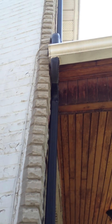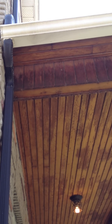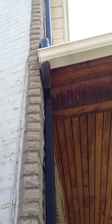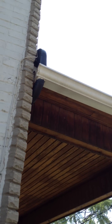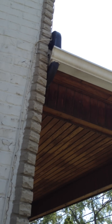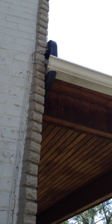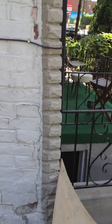I finally discovered that the eaves trough was really the main problem. There was water streaming down in front of the eaves trough, all the way down the wall — just a little bit of flashing that was letting the water drain over. I corrected that and fixed a couple of shingles on the second roof up there, and the basement was totally dry.